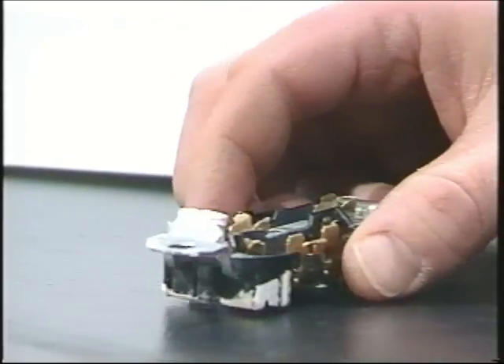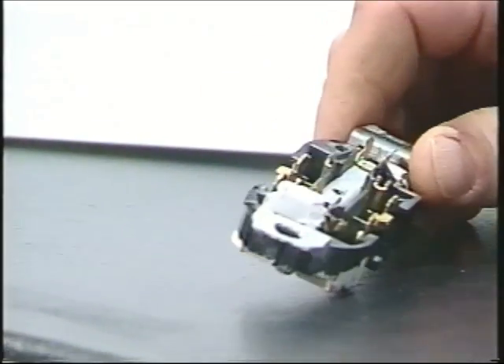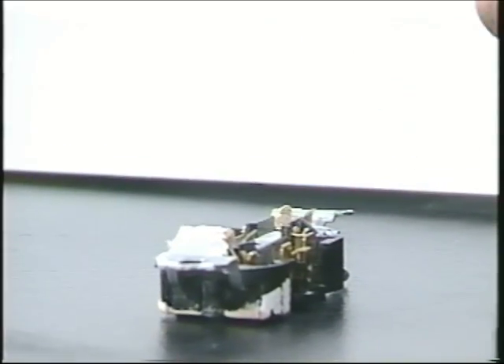Another common problem I've had questions about — a green film on an outlet that sometimes appears. That is actually just caused by grease. There's electrical grease that they put inside the outlet to help the plug slide in and out easily. If you plug in something like a big load, like a vacuum, the heat from that and the prongs inside that outlet will cause that grease to melt a little and draw out.